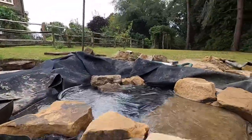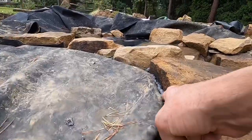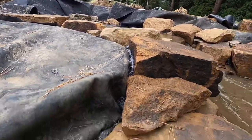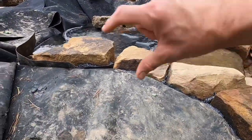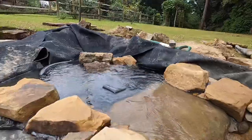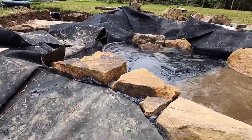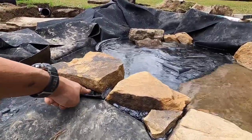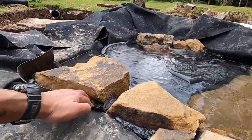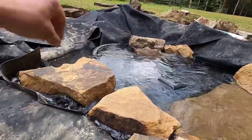You can see how it's constructed — the main pond liner, the cascade liner overlap, and the expanding foam filling all the joints between the stonework. It encapsulates the rock, keeps it in place, diverts all water over the stones rather than under them, and stops any slow trickle running the wrong direction. When complete the liner gets trimmed, and the foam finishes above water level — similar to the concrete behind the pond edging. I want the foam just slightly below ground level so I can fill the voids with soil and grass, which won't wick too much water, though roots will collect moisture as they percolate down.